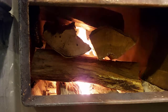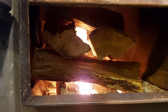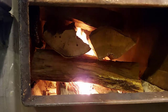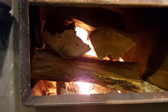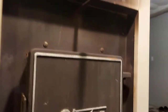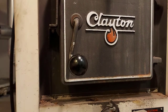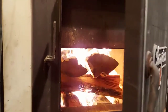As of lighting this it is 10:10 a.m. and I'll show you how fast it heats up — I'll show you that thermometer on the stove pipe so you can see it reaches close to 400 in a short amount of time. Now I'm going to close this door because it has lots of air. We'll close the damper off a little bit — not all the way yet — and we're not going to close the door all the way yet either; let the air feed to that fire.